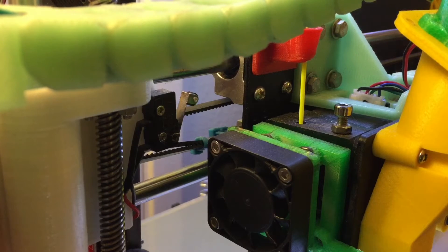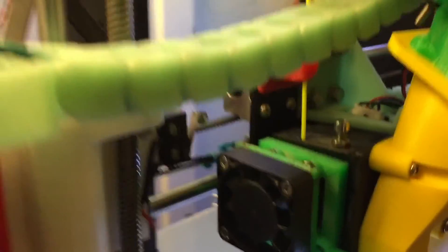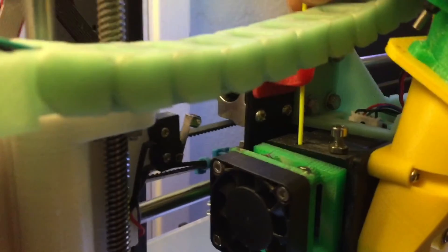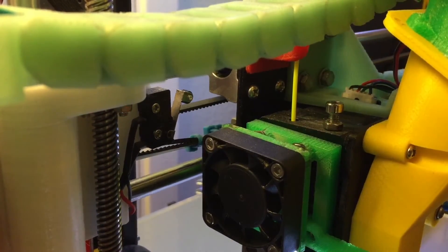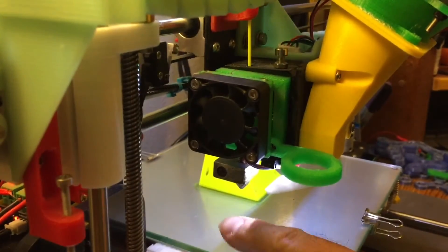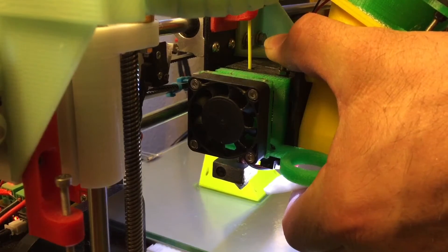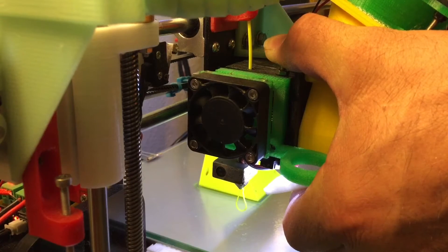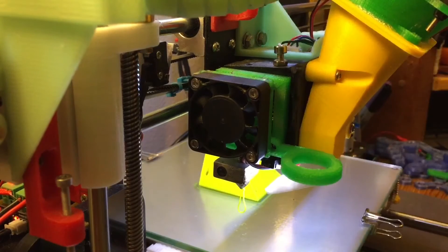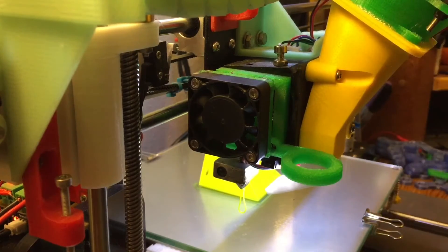I'm already at 110, 115, 120 — mine goes fast. The first thing you want to do is grab your filament from up here and push it down — you want to extrude some filament. You want to see it come out of the extruder nice and hot. Then you just pull it up and out, and you'll see the tip always comes out kind of bent — that's fine, just cut that off.